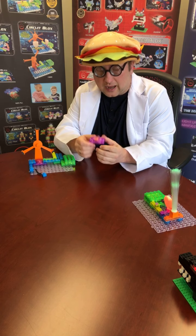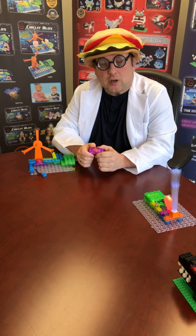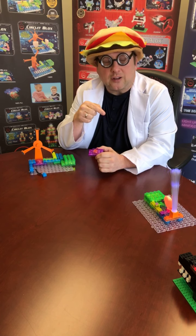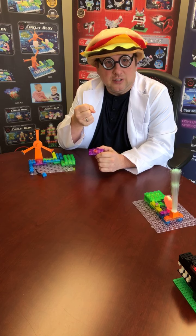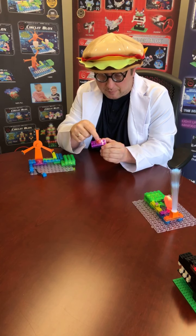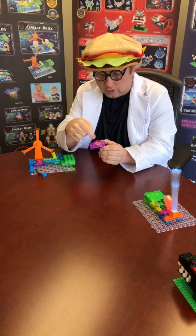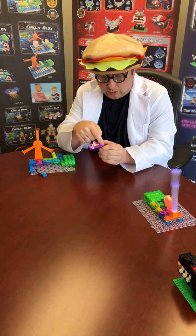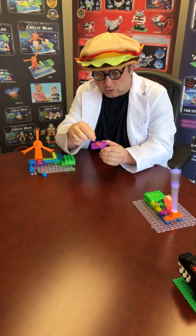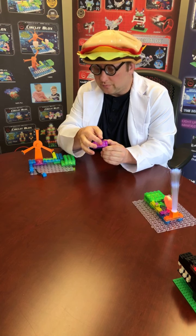Now, inductors, how do they work? It's similar to when we talked about the motor. Remember when we talked about the motor and how when a wire came in and was wound up as a coil, it actually creates a big magnetic field in the motor? Well, that's basically what an inductor does. You can see on the top here, it's just basically a wire that comes in and wound around a bunch of times to make what's called a coil and then goes out. But when current goes through here, it creates a big magnetic field right above that inductor.